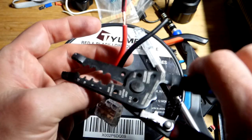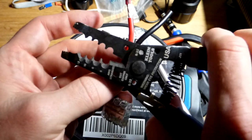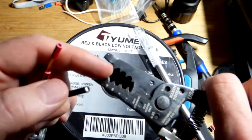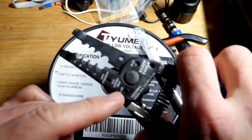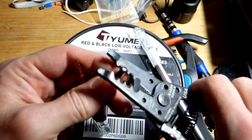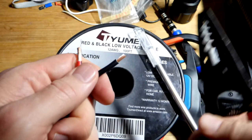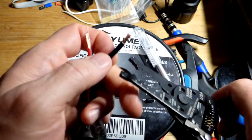To cut the two wires I either had to snip one side and the other with snips, but this one was wide enough where I was able to cut them both. On the end of the tool it says 12 for American wire gauge at the bottom — you just close that on there, and it pulled off easier than I thought it would. I thought it would give me a little bit of a struggle.